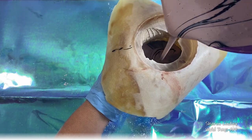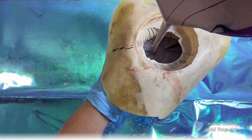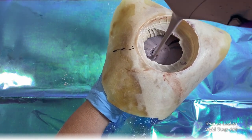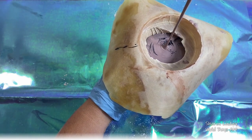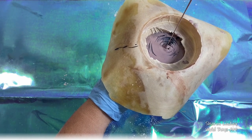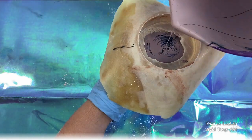and you're going to see me just fill it up to the top, struggle with how to hold it. I then put it inside a plastic cup which holds it straight. I then mix up some more Jesmonite to get to the end. You blow on top of it and it removes any bubbles. You don't apply heat in any way, shape or form, like a torch or a heat gun. Just your breath is enough for you to remove any surface bubbles.